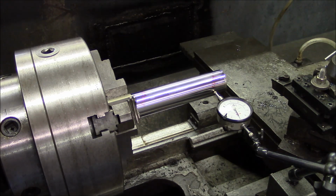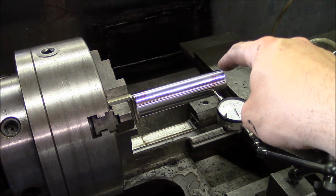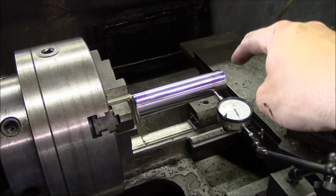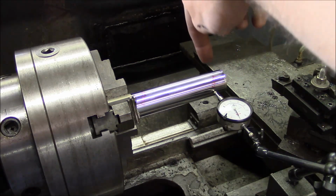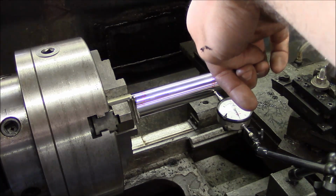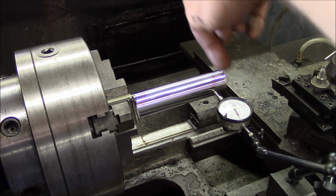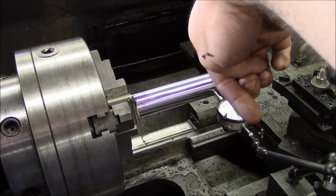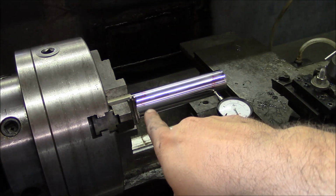So remember, we're 0.4 thousandths big on this end. So what we want to do in order to compensate for that is push this end towards the operator 0.2 thousandths. Remember, we're working on the radius, so everything will be twice as much on the diameter. So we want to push this end 0.2 thousandths relative to this end here,